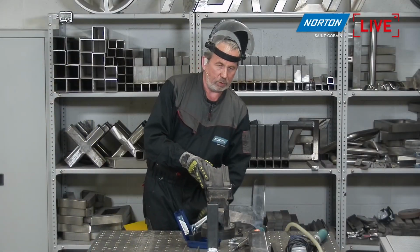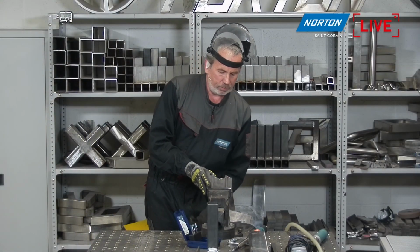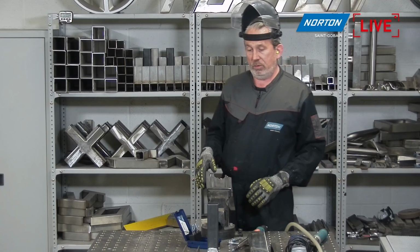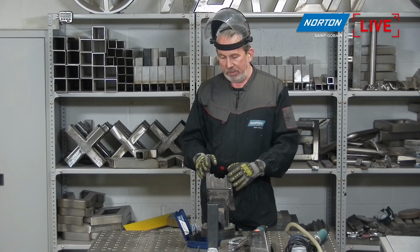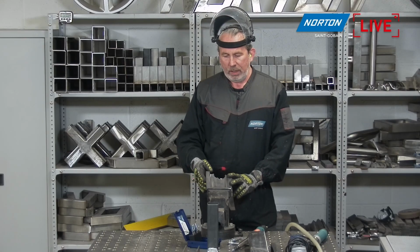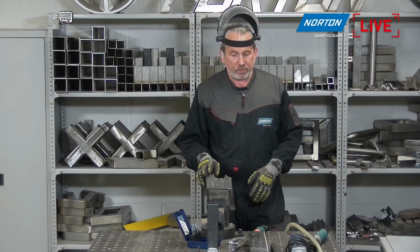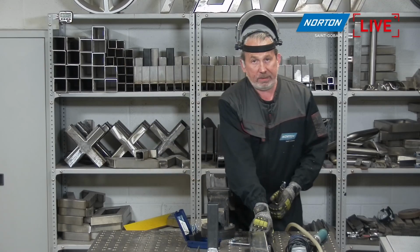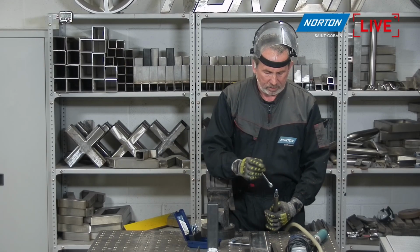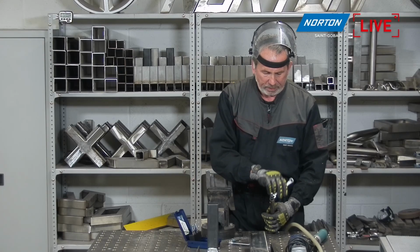So I'm just going to get the nozzle guide vane inside the vise, and we can show you how we use a ball-nosed cone. Right, that's securing the vise there. Now this material, it's not your conventional stainless steel or carbon steel. This is nickel, so this is a high nickel alloy, super hard to grind, super hard material. Again, designed for inside of jet engines, so you can imagine it's some pretty extreme engineering in this stuff.